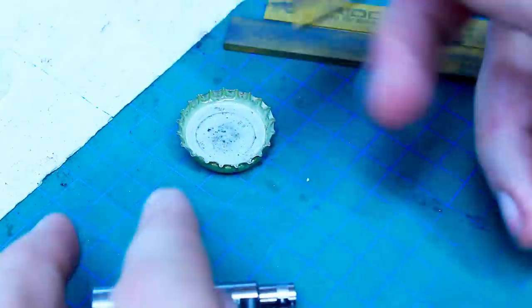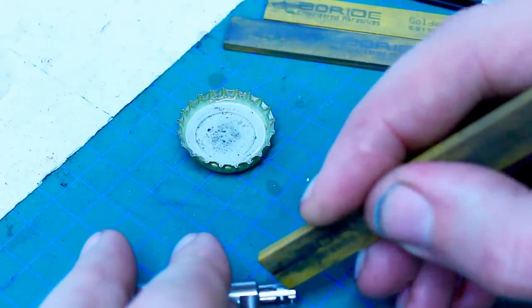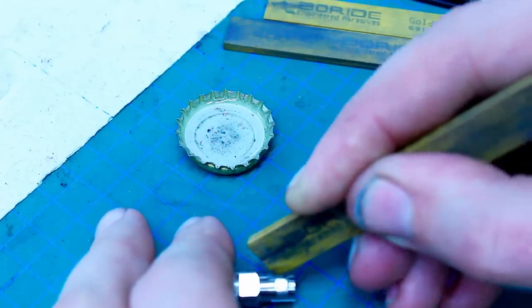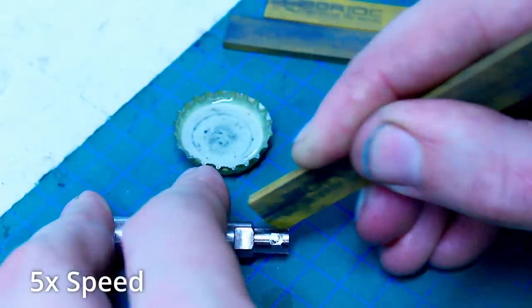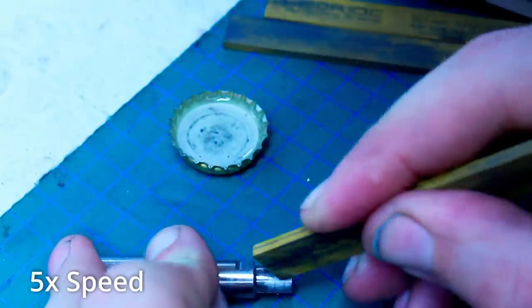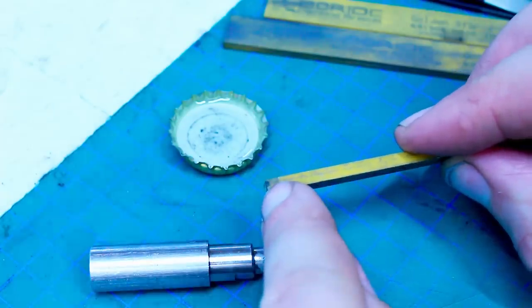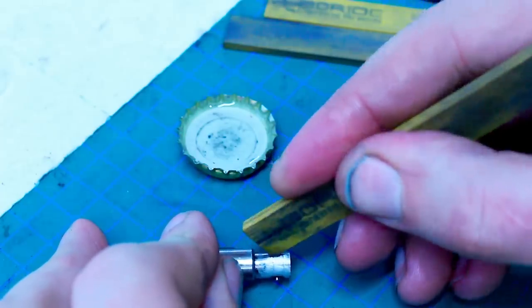In a bottle cap, I just have a piece of a bottle cap here, and then I just go to town. I start out 90 degrees to the cusps with a 600 grit. Let's see how a 600 grit goes. On the stone, you can see that we're already creating this radius of the part onto the stone. This makes polishing way easier once it conforms and you're not on single point or single line contact anymore.